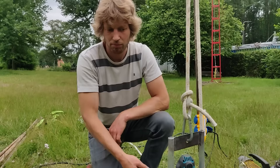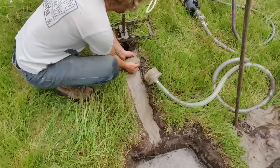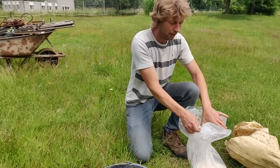Now we wait some time to get all the particles out of the hole. Taking the samples is not only good for determining the type of soil you are in — it also helps you to remember how deep you went.